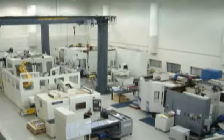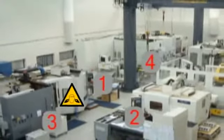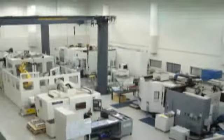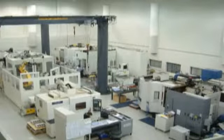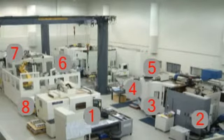If the sound level in the work area is generally the same, measurements should be taken at 5 or more workstations representative of the distribution of workers. In the case of noise predominating from a single machine or line, measurements should be taken at the operator's position and of 3 or more of those nearby. If any measurement is recorded at or above 85 dBA, then the sound level should be measured at every operator's